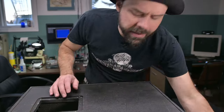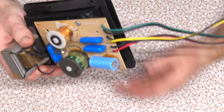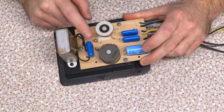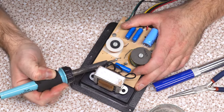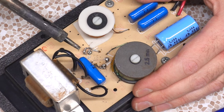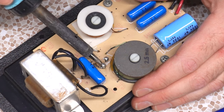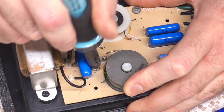The crossover is free. That looks like the mid right there. These solder joints look kind of crummy. We have to disconnect this to get the board off, which is another thing some people shy away from. The wires are wrapped on there pretty tight. Have to give them a peel without melting the plastic. If you're not experienced with soldering, this is definitely tricky. But they're disconnected now.